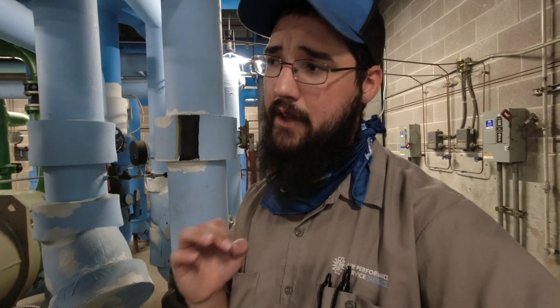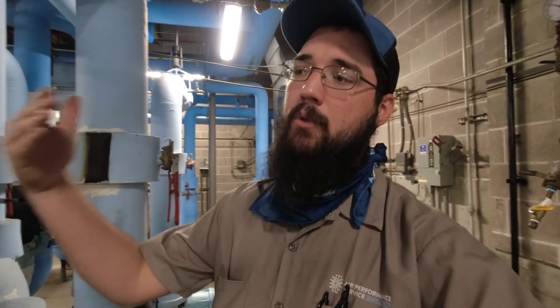In a 24-hour period it cannot pump out more than 50 minutes, and normally you want it to pump out zero in an entire week. This chiller had been doing exactly that prior to everything going crazy — no leak issues, no pump-out issues, nothing. This literally all just kind of sprang up on us. I've got to recover from the stacking issues first, and then I can start to figure out what actually caused them in the first place and come up with a course of action. I've talked enough — I'm going to wrap this one up, leave it here, let it do its thing, and we'll come back to it as soon as possible.